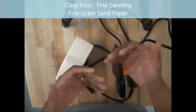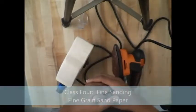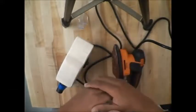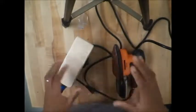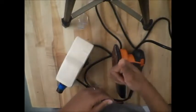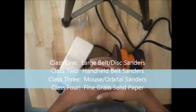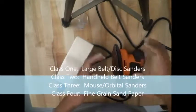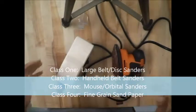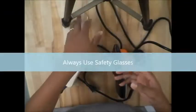The last step for any really fine, smooth project is to hand sand it with fine-grain sandpaper — that's what will make your project really super smooth. So those are your four levels: belt and disc sanders (large machines), handheld belt sanders, orbital or mouse sanders, and then sandpaper.